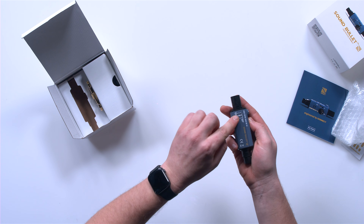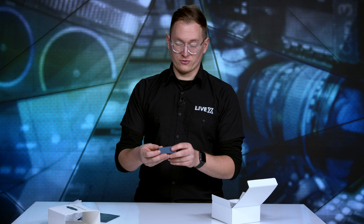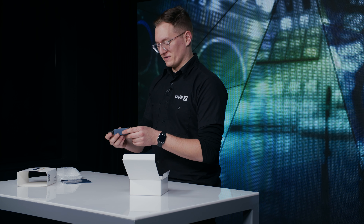On the other side, there's a cable tester. Hold the button for two seconds. So I can test XLR, XLR female or male. It goes through all the pins — you stick one on both ends of the XLR on the device and then you can test each pin. Pretty nice. And you can also check polarity as well, making sure that you're not working with anything that is out of phase with itself.